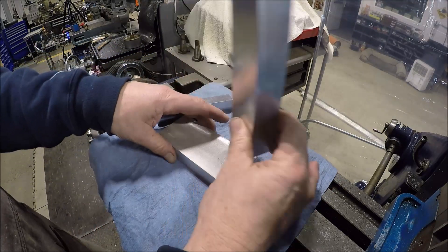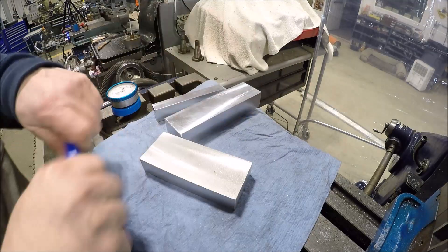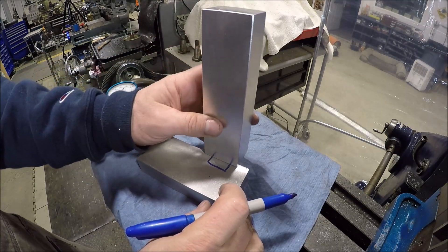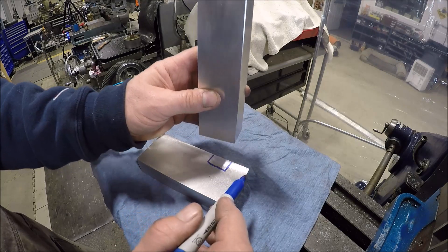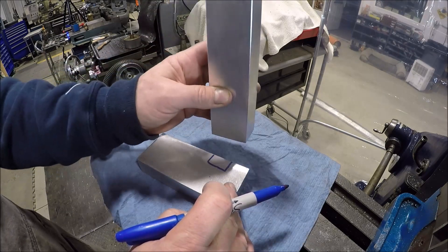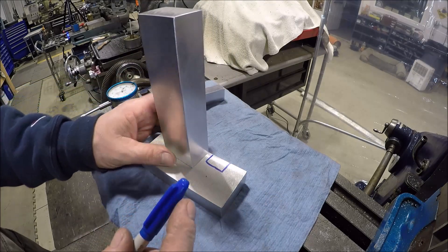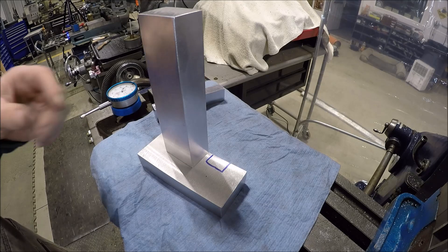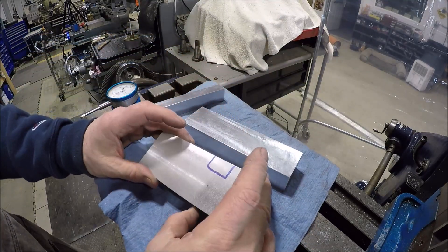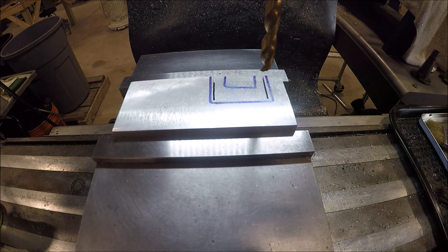I think what I'm going to do is mill out a slot so the column will sit in there. If we mill this right, we know it'll be perfect — there won't be any twist and it won't be off because it'll be fitting in that slot. Then we can just do a couple of screws to retain it so it's not going anywhere, but we know everything is right. I'll go over to the bandsaw and cut out the majority of it, then meet me at the mill. Just came in on the sides with the bandsaw, now I'm going to drill some holes and get this centerpiece out.